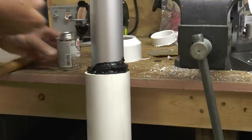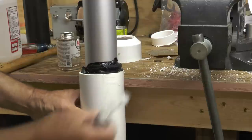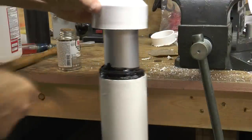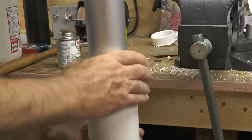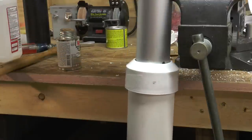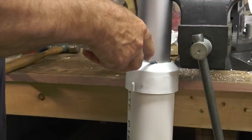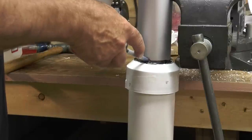Once the antenna is in the concrete, it wouldn't be easy to pump water out of it. Although if you stuck a hose down there and a whole lot of water got in, you could probably pump it out — but you don't want it to get in there to begin with. So we're going to seal the flagpole base up against the PVC coupling with a bead of flex seal. Got to keep the water out of this thing.